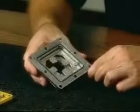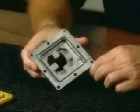What I have here is the spray cap that delivers the spray cooling to our MCM. What you see here is four spray nozzles per processor chip and one spray nozzle for the cache chip. The cache chip runs about 40 watts.